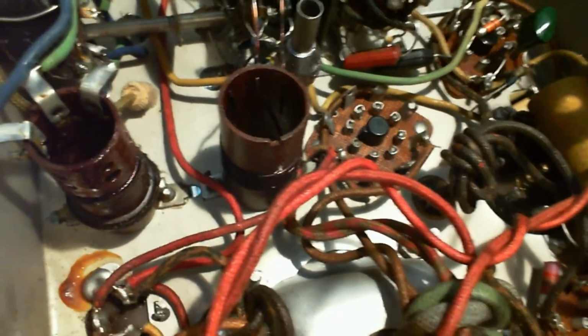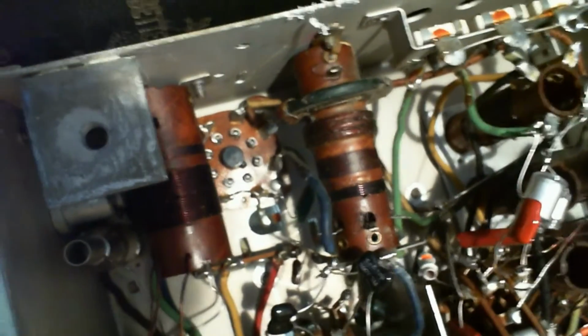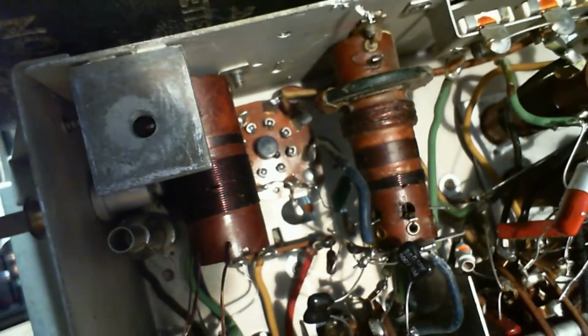I'm willing to bet there were a lot of secrets learned in the heads of the people designing these coils, secrets they wouldn't share with other designers. But just really simply, see how this is open facing, let's call it facing up. Open up, up, up, up, all the same, but not these. These are turned the other way, 90 degrees. That's not done by accident. That's probably not done for space reasons either. It's done to reduce the amount of interaction between these coils.